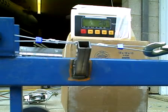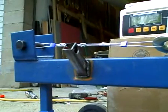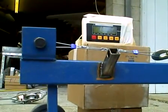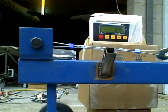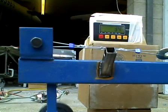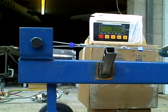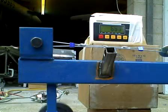Alright, we're coming up. As you can see, we're showing like 35 pounds, and the wire's starting to come tight. I'm going to give you a better angle so you can see the girth hitch a little bit better. Looks like the sun is obscuring the readout. I think you can see it from there. I know the girth hitch is obscured by that part of my test stand. The girth hitch is coming up tight, and you can see the readout showing 450 pounds, 500, 550, 600, and 700.